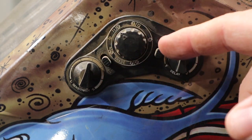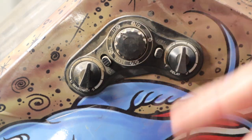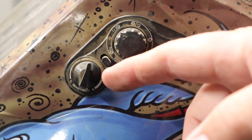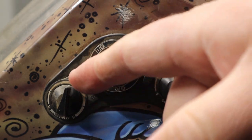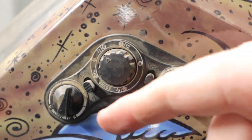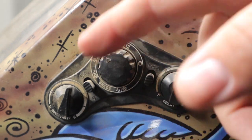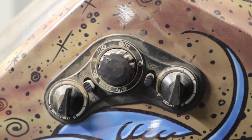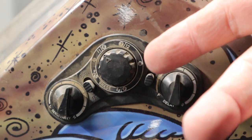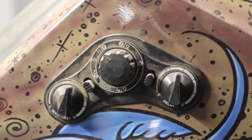On the other side — which is a feature of this nicer, higher-end helmet — there's a switch on the left that lets me change between shade ranges of 5 to 9 or 9 to 13. On the 5 to 9 setting I can dial in shade 5, 6, 7, 8, or 9, though many of those lighter shades may be too bright for a lot of welding processes. On the 9 to 13 setting it runs from shade 9 up to 13, with 13 being the absolute darkest.